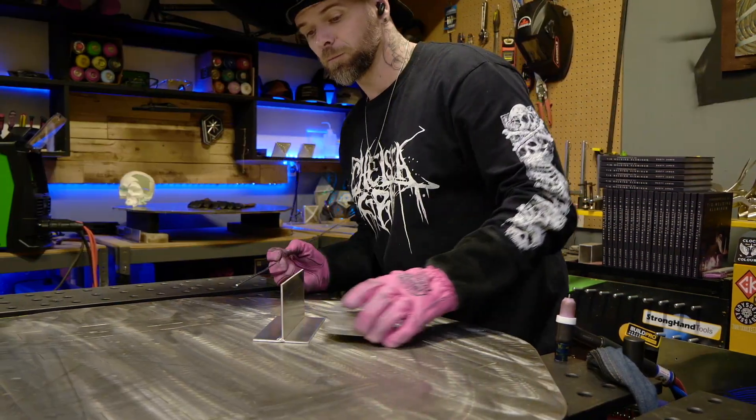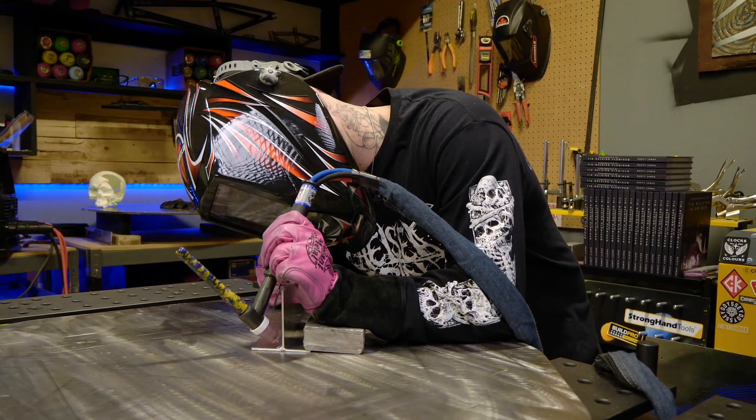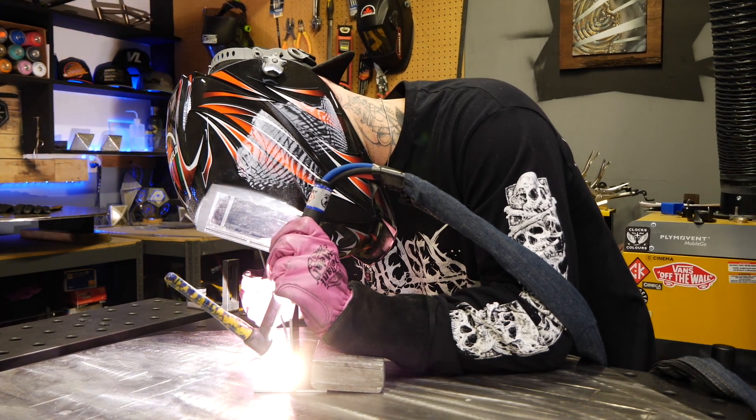It's the same deal — just flip it around so it's facing the other way. Find a way to position your hand or wrist so you are stable and not going to get burned, then start your second pass welding towards the center — this is your overhand grip. The fillet weld is something most of you have probably done many times before. It's one of the most fundamental joints everybody gets taught in school. This is the way I used to weld this joint over and over putting in reps when I was younger. Finding this new overhand grip is a new way to challenge yourself.